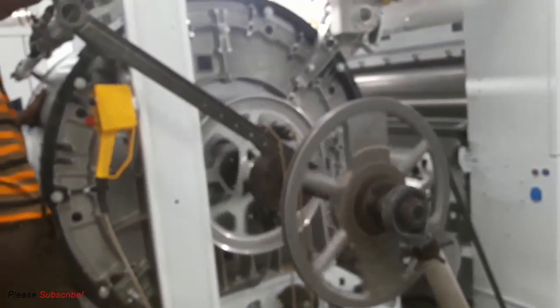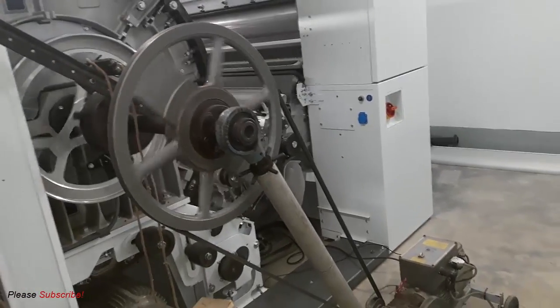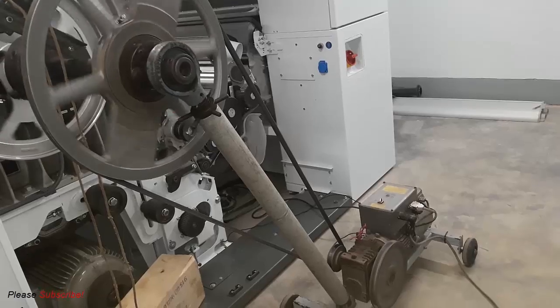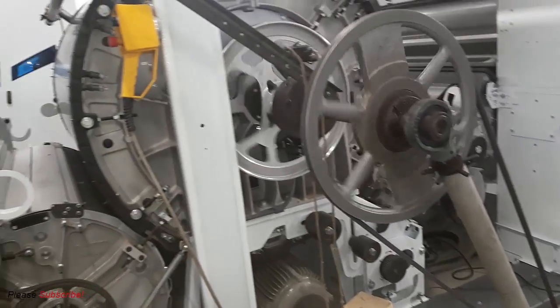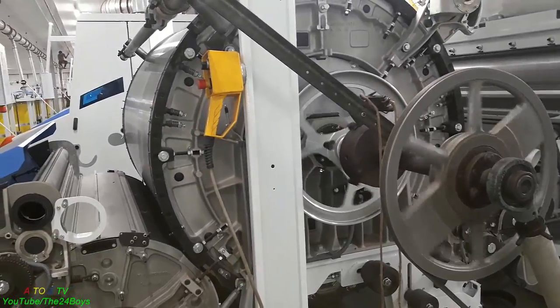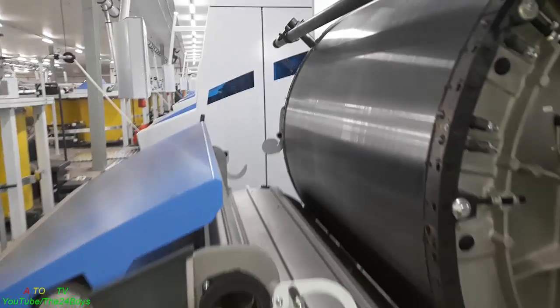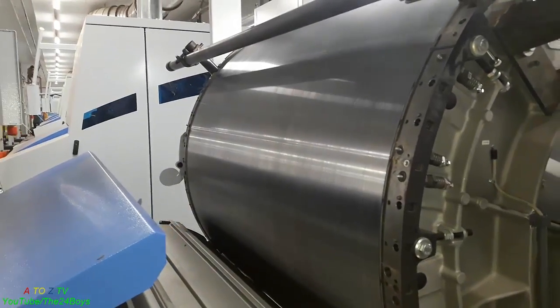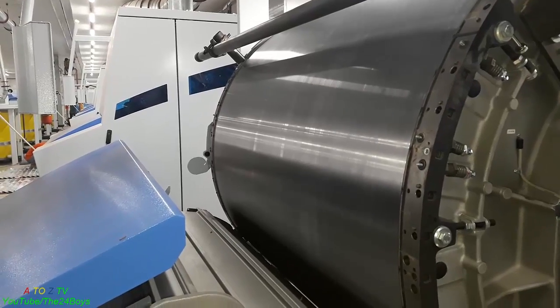Yeah, there is some extra electrical part. There is a drive, an AC drive which is controlling a motor, and at low speed, of course, because this is the only way that you can remove this cylinder wire from the cylinder. And of course you need to use a motor which runs at low speed, because high speed is really dangerous for this operation.